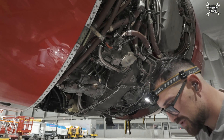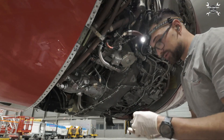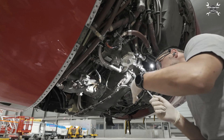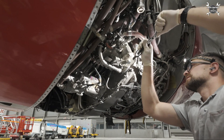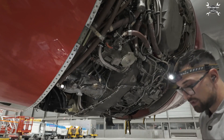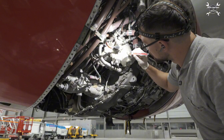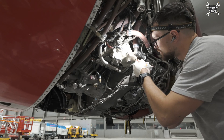Good job done. Now lock wiring — lock wiring is done. All that remains is to secure it in place with the lock wire. That's it — now we need to give it a bit of cleaning. We can also apply a torque stripe on the bolts; this way you will always find out if a bolt has moved.